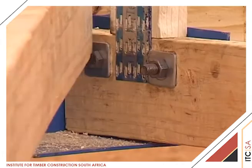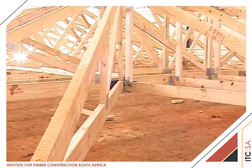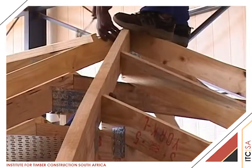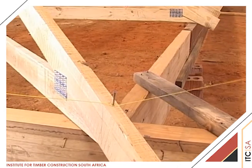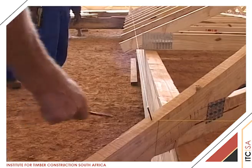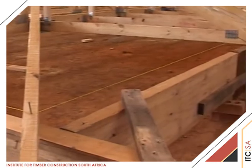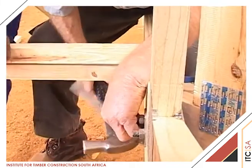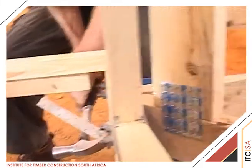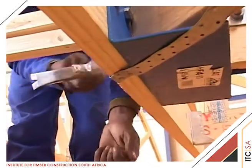These HG1 hip girders are now placed in position over the corner of the building to the apex and nailed in position. A fish line is now pulled over the top cords at the heels of all the main trusses and along the line of the jack trusses around the corner to ensure that all trusses are level. Once this task is completed, the jacks and hip girders are finally secured and nailed into hangers and the anti-torsion strap secured.